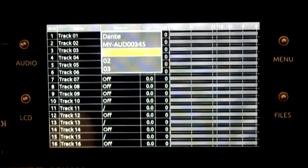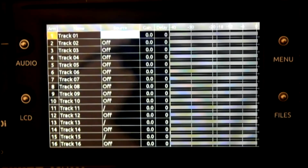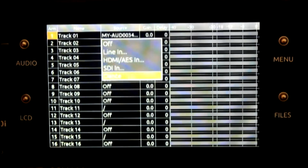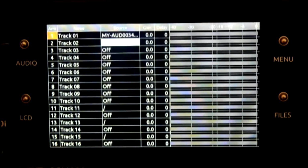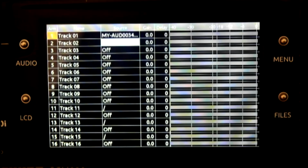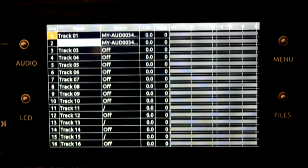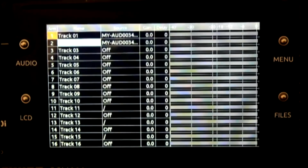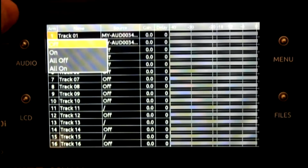So I'm just going to pick channel 1. And it's going to fix that in there. Then I can move down to the next channel. I can pick Dante MY channel 2. Now I can change these names to be more representative of what I want to do, but as far as the Yamaha is concerned, I have to use Dante Controller to do that. I can also change track names by just hitting enter. I can type it in with a keyboard or use the rotary knob. I can arm a track simply by turning it on.